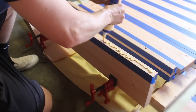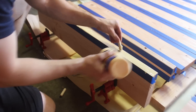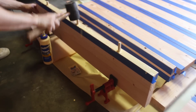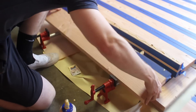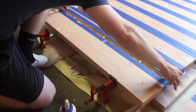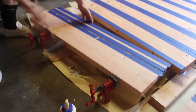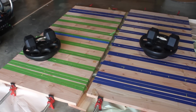For the next set of doors I did one panel at a time and it was much better. If I could do things differently and had more than one weekend to build these, I would have glued up my panels in sections of three or four and then gone back to glue them all together in a second round. I found it difficult to clamp everything up at once and keep it flat — had I not had access to a bunch of weights to lay on top, I probably would have been screwed.